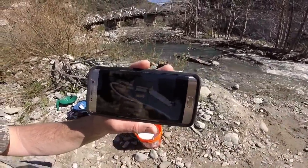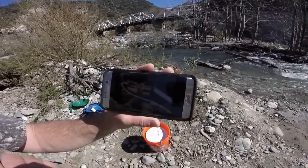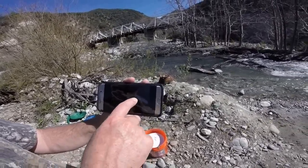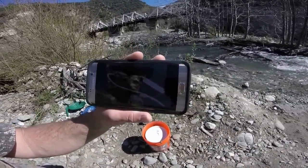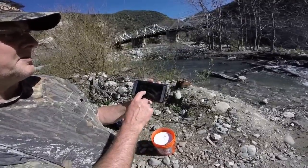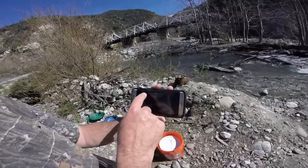That's on the sluice I've got out here now, but since then I've gotten a different sluice that it works on where it's just straight instead of the little flare on the top of it. And then that's the little stand that I made that has the different angles and everything, and it's just a piece of folded sheet metal on the back, so you don't have splashing going on. You can run the tailings off real nice, and then I just feed it with a single 2,200 gallon per hour electric pump, and it works pretty good. Yeah, that's how it comes off of the table at the end.